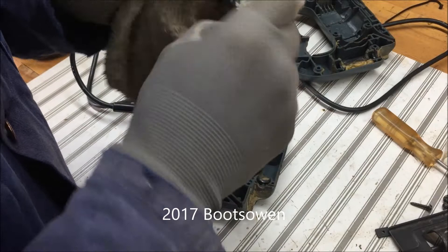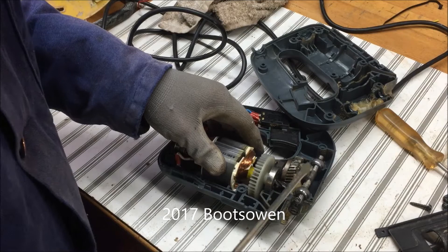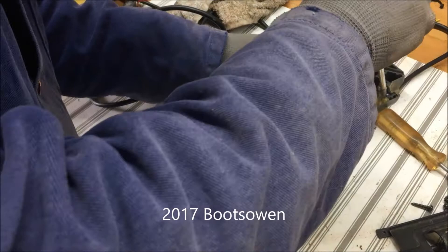I wouldn't use this very often — I don't use a jigsaw much, and it's not a very heavy duty model, but I've used it for pretty much everything that the blade can cut: worktops, any kind of timber. But here's the critical bit — there's a load of greasy shmoo on the other side, which was originally in it and has probably dried up a little bit, but I'm just repacking all of the moving parts with that grease.